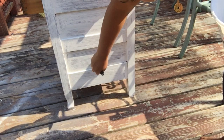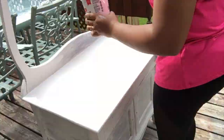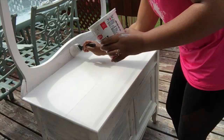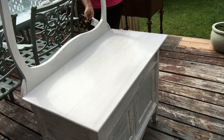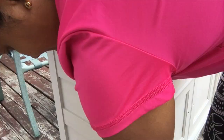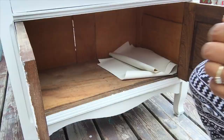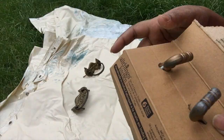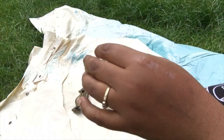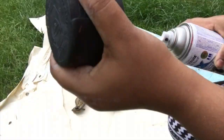This project is really simple — I wanted everything in bright white, so I paint the drawers and the bottom, everything in white. After the paint had time to dry, I use sandpaper from Dollar Tree and sand certain areas to give that rustic farmhouse finish. That way if any paint chips along the way it looks intentional. For spray painting hardware, I poke them into a piece of cardboard so they stand straight and I can get all sides. Here I'm using Rust-Oleum spray paint in black, giving a few coats to make sure everything is completely covered.